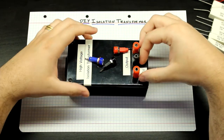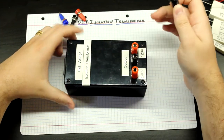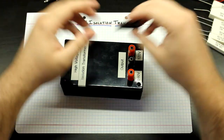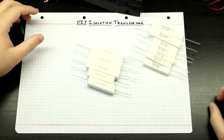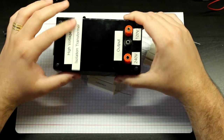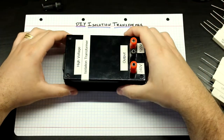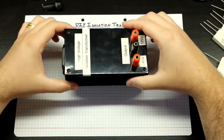I'm going to use an existing project I have — a very old isolation transformer I built around five to six years ago. I'll be replacing the binding posts because high voltage is present and exposed metal isn't safe. I've ordered inset binding posts, similar to a multimeter style. I also bought a fuse holder so we can access the fuse from the outside.